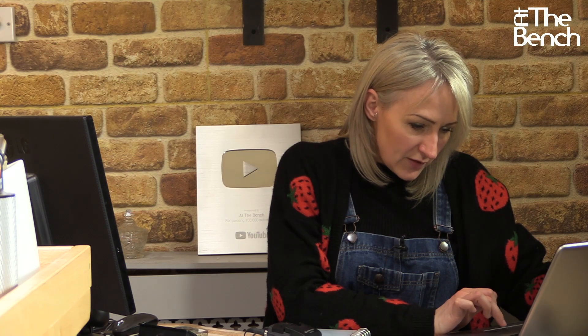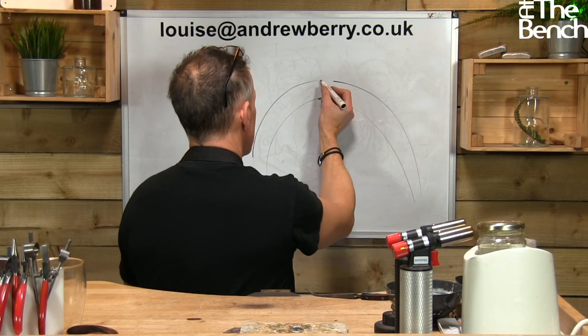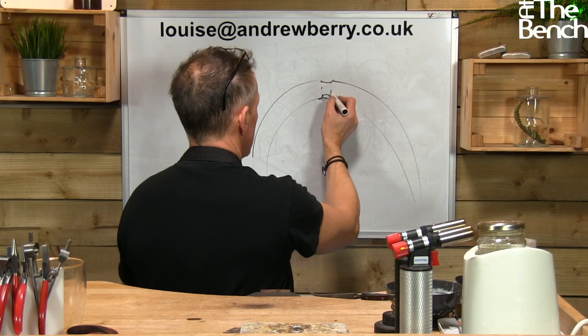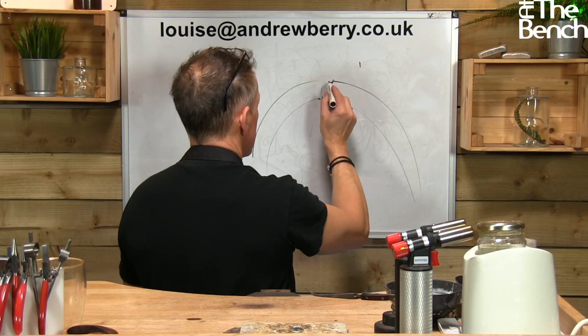I was wondering if you have a YouTube posting on anything platinum constructing and soldering. I don't like soldering ring shanks at all when it comes to platinum. The reason being is that the composition of a platinum solder is softer than the platinum itself, and as soon as you start to polish the platinum, the polish will drag and take out more of the solder than the surrounding metal, so your ring shank will have a little bit of a divot where your solder joint is.